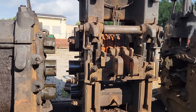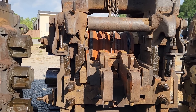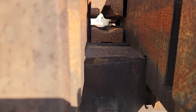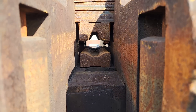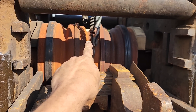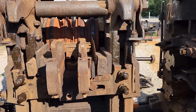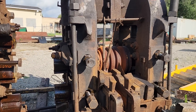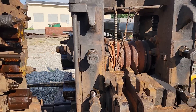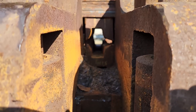The next one we have here is mill stand number six. The top two off the pinion would rotate these two rolls. You can see down through here it was kind of making a T-section. Those are mill guides, and then they have the roll that is carved out to make that section. So that steel would pass through in that direction. And then next to it is mill stand number seven. That steel would run through, transfer over, and then come back through this way here.